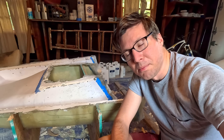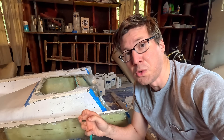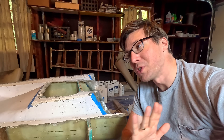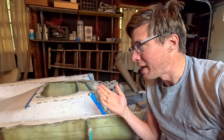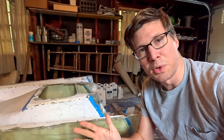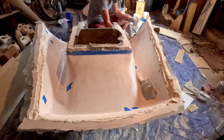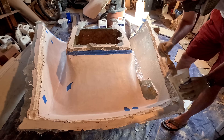There are a few holes in the mold itself where the gel coat has chipped off, and you can see the fiberglass strands. I know that when I put the gel coat in, it's going to fuse to those strands and make it really hard to get the part out. Ideally, if you had more patience, you'd fix those areas — put gel coat, sand them smooth, get everything perfect. But I'm kind of tired of working on this mold and I just want the part. So rather than spending more time on it, I'm just going to put tape over those holes and get cracking.